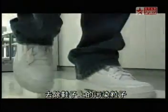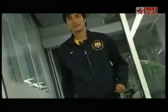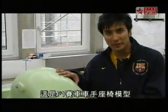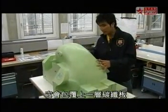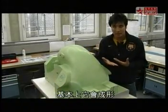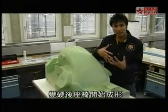We're going into the clean room right now, but before that everyone has to step into this white strip so that you leave any kind of particle from your shoes behind. This is where all the carbon fiber parts are laminated. This is a mold of the driver's seat in an F1 car, where a layer of carbon fiber will be put on it and later sent to the autoclave, which is like an oven where it will be cured, harden and become stiff as a beginning product of the seat.